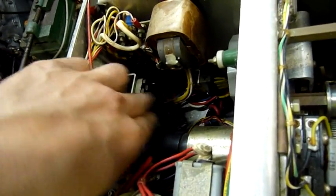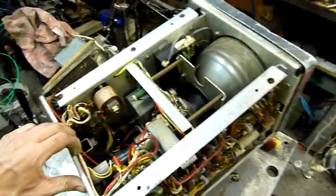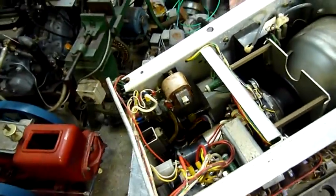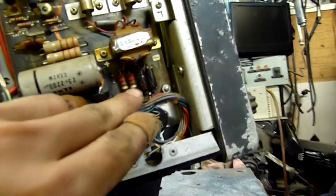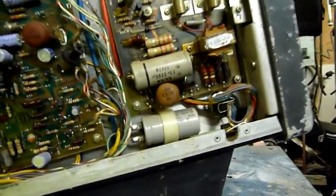There's a small transformer — actually no, it's only two wires, that's a ballast. Just as I thought, there's the multi-pin connector to go into the unit, so this and the rotating scanner head is all there was to the radar. The rest of the machine that got scrapped was probably the rest of the autopilot. In theory if I had the loom that went with this I could just plug it in, but at the moment it's a wild goose chase to work out what pin does what. Those resistors look toasty — they're crispy. I don't think this will ever work again unless I replace them, but I'm guessing they're the same as these two nearby ones, so I can replace them and at least try to get the thing to power up.